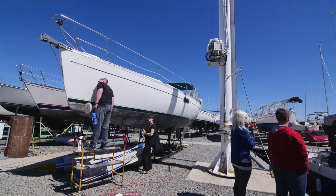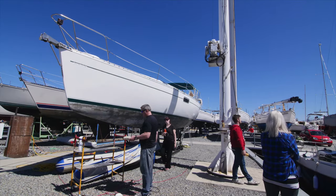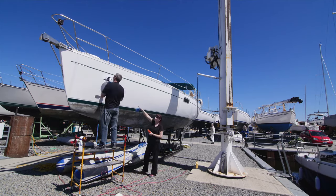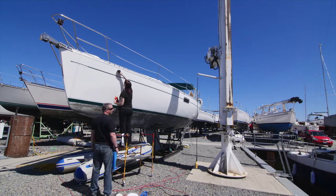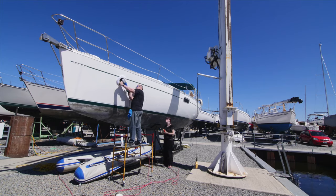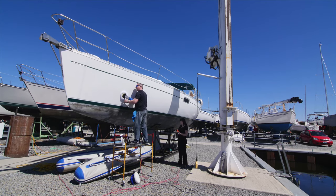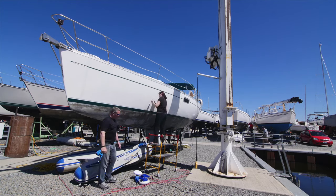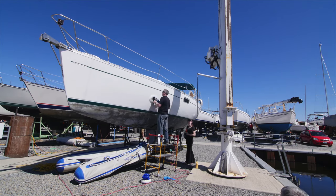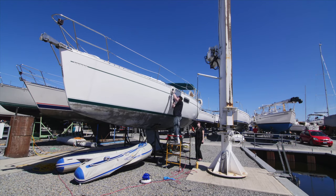Oh, it's so sunny and nice. That's when even more work begins, but at least it's sunny and we're in a great mood. What you're watching us do here is wax the boat, but I didn't film the stuff that came before this. First, we had to take the winter cover off and all the ribs. Then we had to wash it to get off the grit, then deoxidize — which is sort of like a wax where you buff it and it takes the cloudy oxidization off the fiberglass — and then finally you're at this stage where you get to polish the entire boat. If you look closely at this time-lapse, we are not very happy with how it's coming out. We keep redoing spots over and over. We learned something: the shady side of the boat waxes real nice, but the sunny side just did not want to buff in. So we decided that's enough of that for today — we'll start painting the bottom and come back to waxing later.